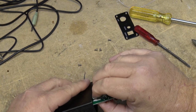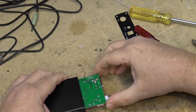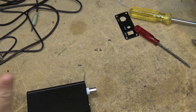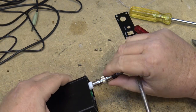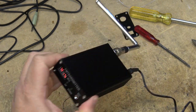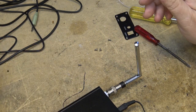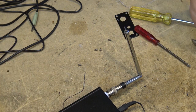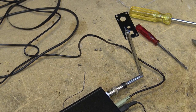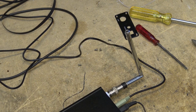I should point out that this transistor is pressed against the heat sink quite well — I actually had to bend it down and slide it in, so it is making a good connection. There's just no thermal compound, although it's probably not going to produce much heat at the power level they're running it at. Anyway, let's plug this antenna in and put power to it. I've set it to 87.5 MHz already — that's what it started out at. Let's just see if I get a signal. I'm getting a signal — of course it's going to hum because I have no ground on this thing. Let me put some music on and see how it sounds.